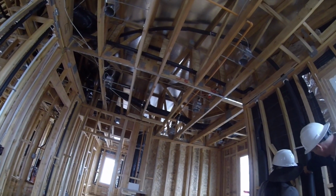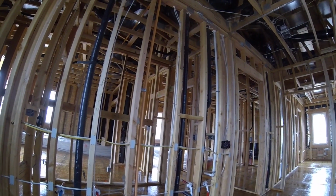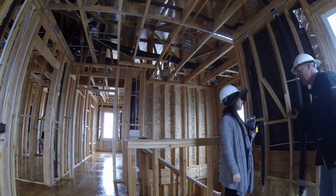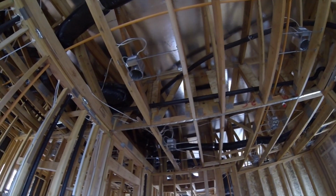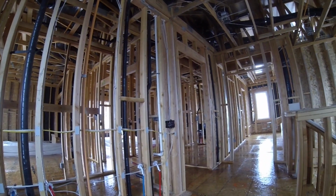If I open this up, it's not a problem, you can open it up. See, it's still made out of copper, right? So this is what you have to do with copper in order to insulate it. But you can't use PEX piping with Freon, so it has to be copper. If you pump Freon through PEX piping, it would get brittle and crack, because it's too cold. It's like below 0 degrees or whatever it is.